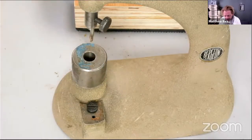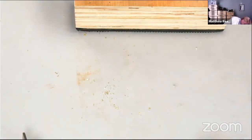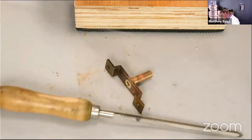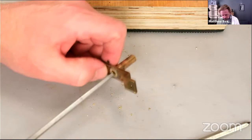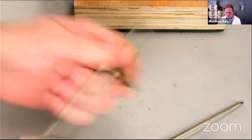Yeah, that D cutter's really struggling on this material. It's incredibly sticky. So I'm going to try a broach. I suppose I could drill it actually as well, but that would be a bit wild. Yeah, that bushing tool's really useful with those things. I don't particularly often use it for bushing, but I do use it a lot for reaming. Ah, that's better. Gosh, much nicer using a broach.